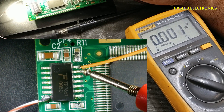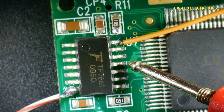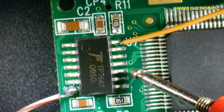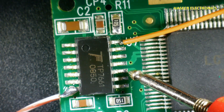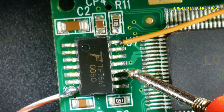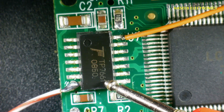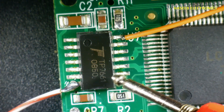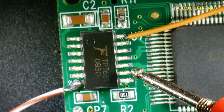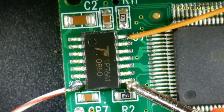Pin 11 is the power-off pin. There is also an RV — a variable voltage pin — if you want to make the voltage variable, you can adjust it. However, for variable voltage operation you need the 7661B variant; the standard 7661 will not vary voltage. This pin is connected to ground. Pin 8 is the output pin.